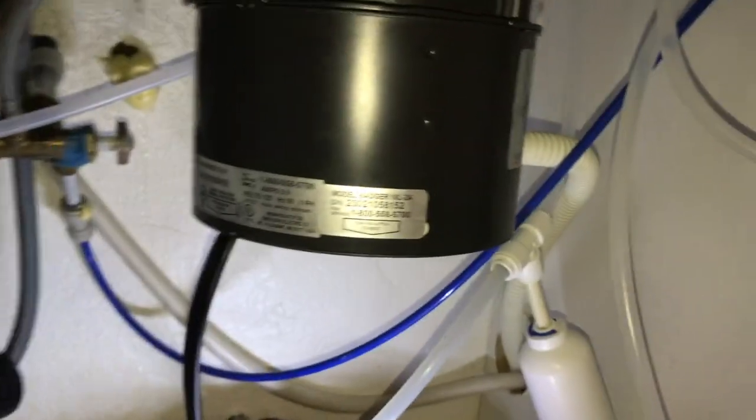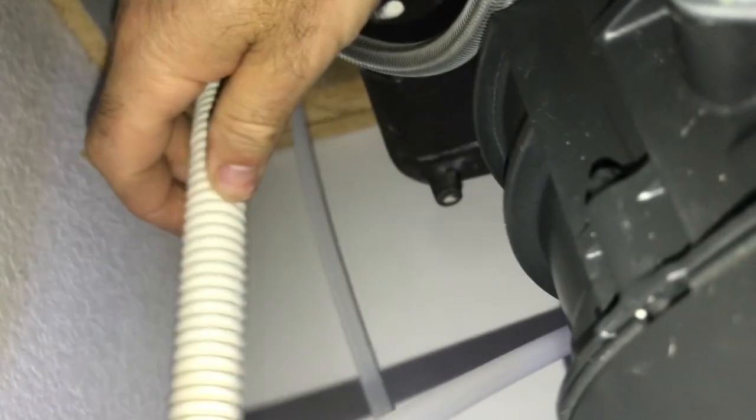So we've come under the dishwasher, or under the sink here. Our dishwasher's flowing out, and we have to eyeball here and determine what's causing the issue. On ours, that air gap is the second one. It's let up. This comes from the dishwasher and it comes up to that air gap. And then there's a black hose right here that comes down to our disposal.